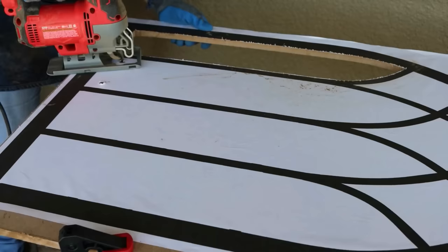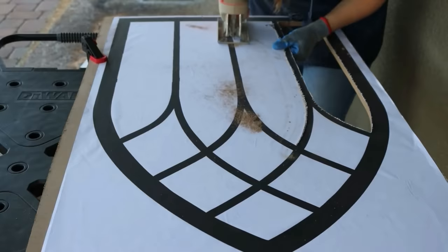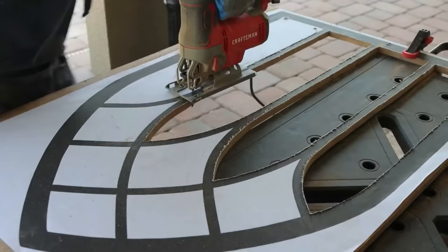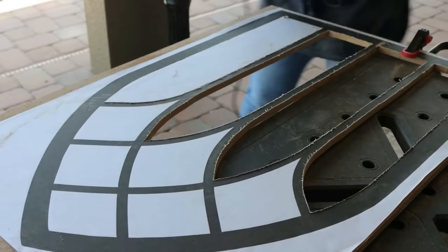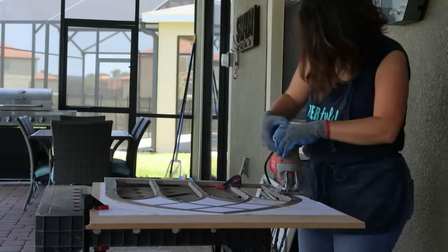One whole panel done, nice and clean. You can get a jigsaw starting around $30; I used a $30 one for several years, then recently upgraded to one I got on sale for around $50 — there was a tremendous difference in ease of use and quality of cut. I recommend spending at least that. You start cutting in the jigsaw hole, work your way to the line, cut along it, stop at the point, lift out the jigsaw, flip the blade, and go the opposite direction to the next corner. With interruptions and filming it took about an hour and a half.